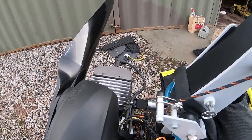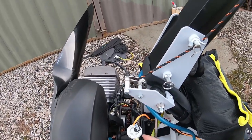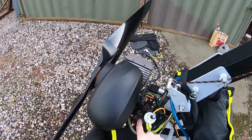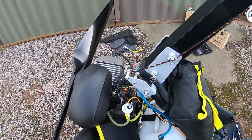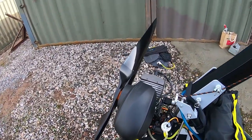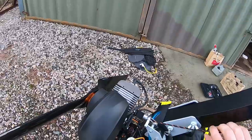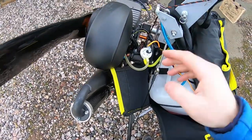This has to be oriented this way up and there's an out arrow here, so that's going back to the main carburettor. I've already primed it and this is the pickup. I've mounted it on this stub because this stub isn't going to move — the vibration mount is — and I didn't want too much more vibration going through it. Wherever you mount it on this airframe there's going to be some element of vibration. In the pictures it shows it mounted right near the engine, but I wanted to mount it above it, and I've made sure everything is going to be clear of the pull system.